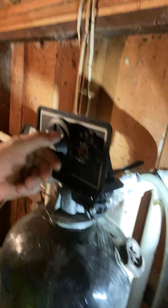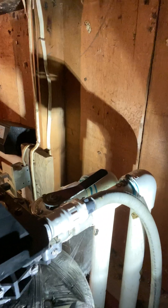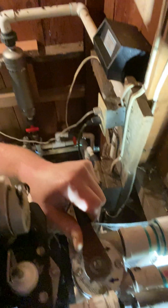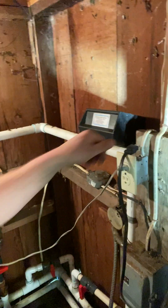After you get it there, this piston's a little sticky. When you get it going like that, you come back here and turn this thing to the left across the pipes — just like that. Go back up front. Most of the time these don't stick but this one does. So now there's no more pressure, everything's in bypass. You're going to unplug it from the wall, and then go over to this dome hole plug and loosen it.